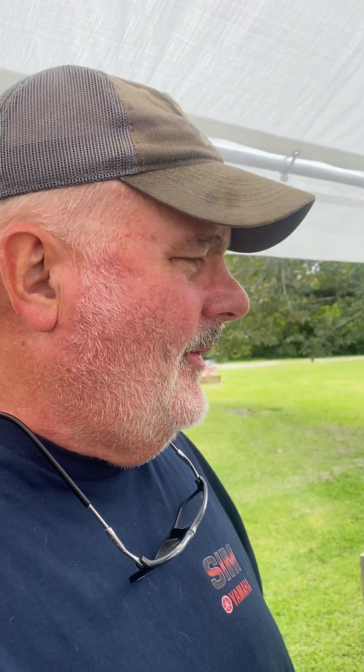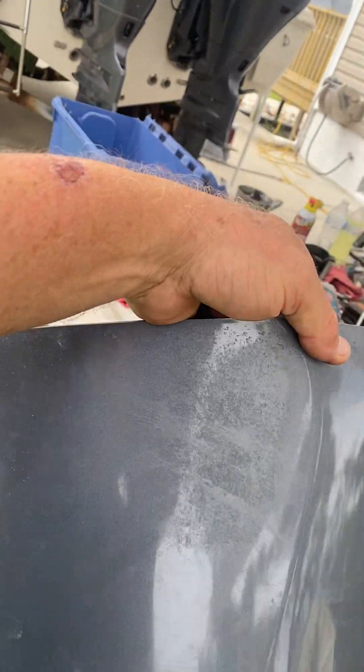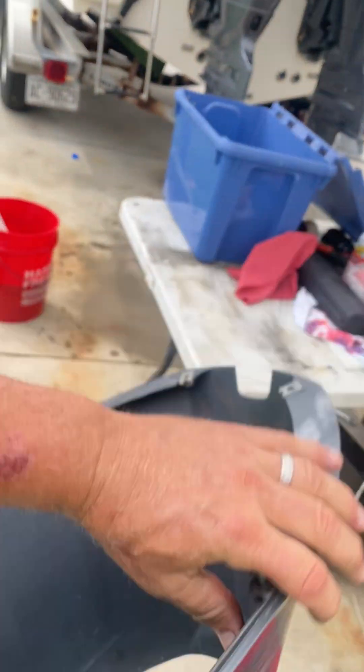Welcome to the show. I want to talk about my Yamaha 150 2016 four-stroke LF150XB. I just finished putting it back together — still need to put the lower cowling on. What happened is I started hearing a strange sound when I was out fishing; that left motor sounded different. One day I was crawling out of the boat and I noticed a hazy area on the lower cowling. On the inside you can see a white spot — that's where the exhaust guide blew a hole through it, allowing exhaust to come out through the exhaust guide.